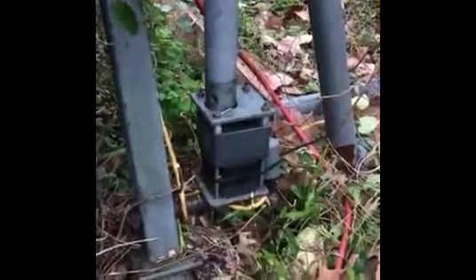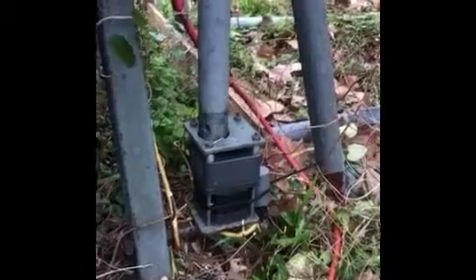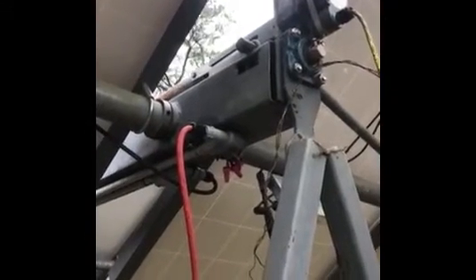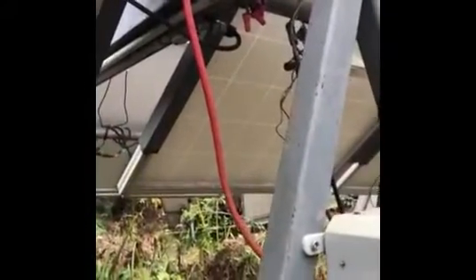There's the actuator, and you can see a pillow block bearing below that motor. This actuator goes down to the ground because the stroke is pretty long, and there's one of those gearhead motors — this motor is probably two watts, so the idea that you spend a lot of energy moving something is fallacious. You can see these spars to which the panels are connected. There's a piece that looks like six-by-six square tubing that is the backbone. That motor up there turns a lead screw, and a nut on the lead screw pushes a rod connected via a lever to each of these spars — that's how the tilt actuation happens.